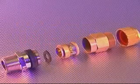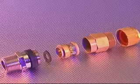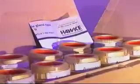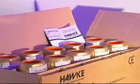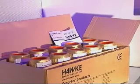The 701 cable gland is for use in non-hazardous wet locations for all types of metal clad cables and is supplied with a black deluge boot. The process for fitting this gland is similar to the 711 and 713 cable glands with the exception that the compound potting process isn't required. Assembly instructions are supplied with each cable gland. Please refer to these for further instructions on cable preparation and installation.